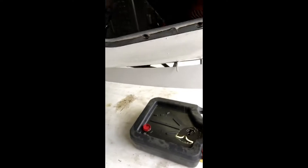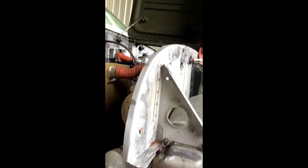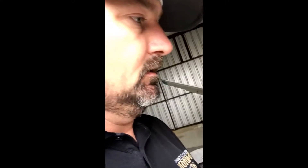We're back and it's still draining a little — there's still a bit more left. So what we've started to do is take the safety wire off of our oil filter. For anyone who doesn't know what that does, it's an extra added insurance that the oil filter won't spin itself loose in flight — it keeps it secure. Most everything on the airplane that bolts up tends to be safety wired. You can see on the starter here, safety wires are on the bolts so they won't back off and come loose.